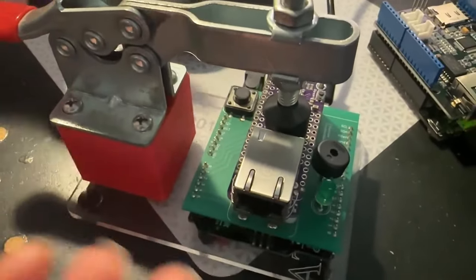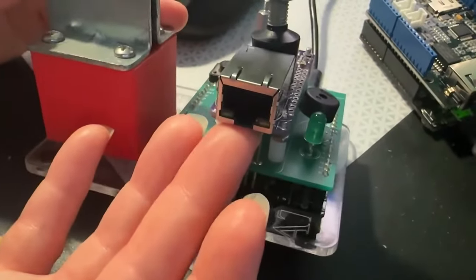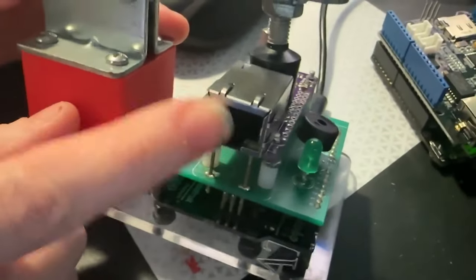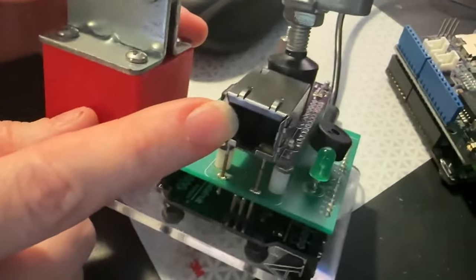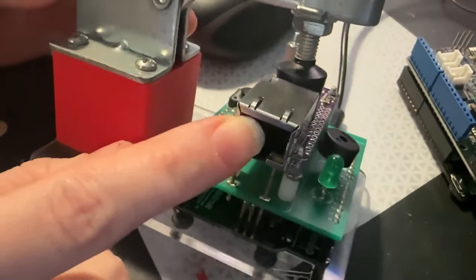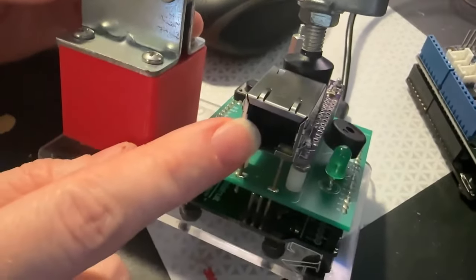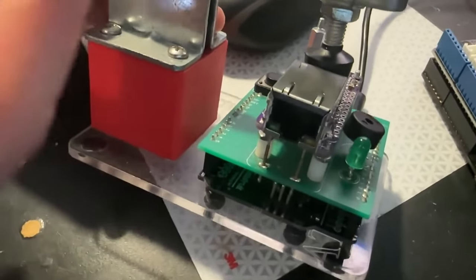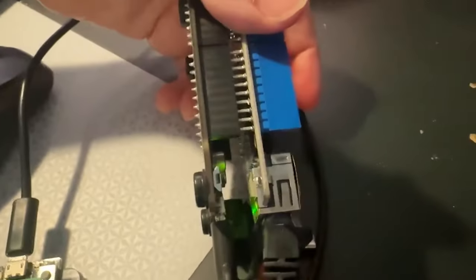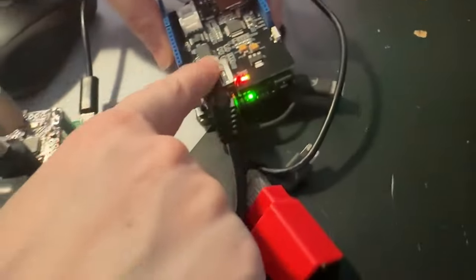And the best way to test it is to actually send and receive Ethernet data. But one thing I've noticed is not everyone who is testing the boards always has an Ethernet jack near them. Sometimes they're a couple feet away and they don't want to get a 50-foot cable. So I was like, instead of plugging into a router at Adafruit, let me make a standalone Ethernet testing jig. So what I've got here is a Metro 328, an Arduino compatible, with an Ethernet shield.